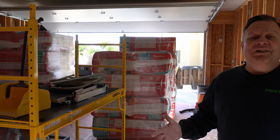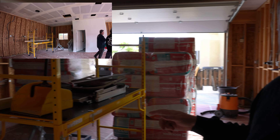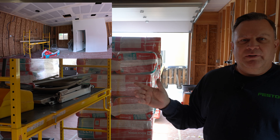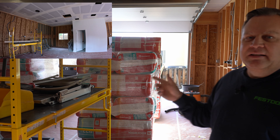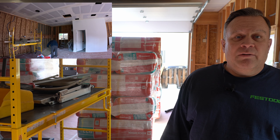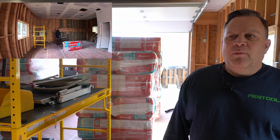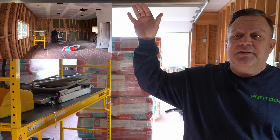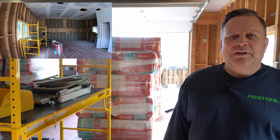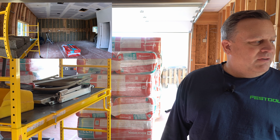Now, why we're here today — the insulation. I have three pallets of insulation. I ordered rock wool, like I mentioned in previous videos. These are actually the R23 insulation — not the rock wool Safe and Sound — although these have properties to hopefully make it quieter in here for my neighbors. I have R23 that's going into the walls. They come in four-foot batts; I'm going to put a four-foot batt on the top, a four-foot batt on the bottom, and most of the cutting will happen in that middle section, though there's going to be some additional cutting too.